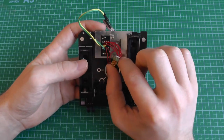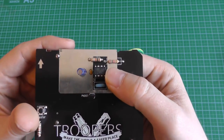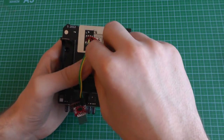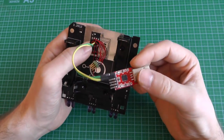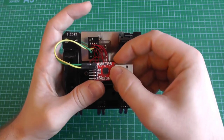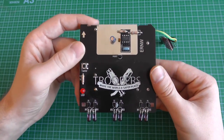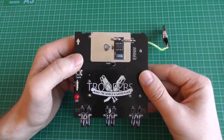And what I did is I soldered this programming header. So this uses an Atmel ATtiny85. And on the back, this is the in-circuit, in-system programming header for programming Atmel's devices. I even used a serial output, and this is why I have this UART to USB converter, so I can debug it. I had 2 ways to debug it, the serial output and this LED blinking here. And with that, I just programmed the code itself on the raw chip.